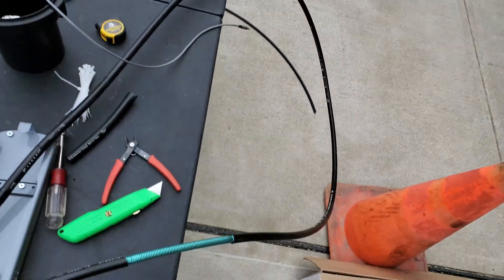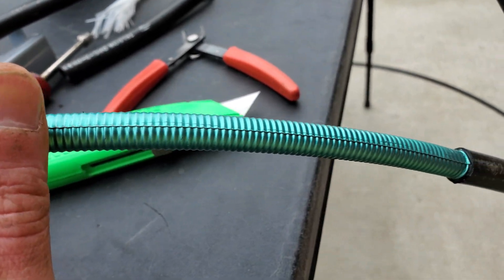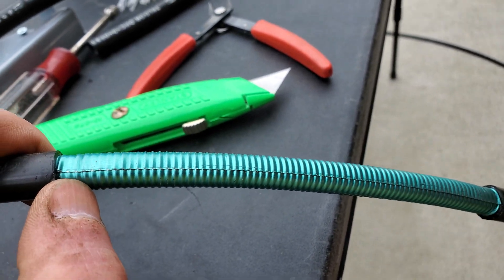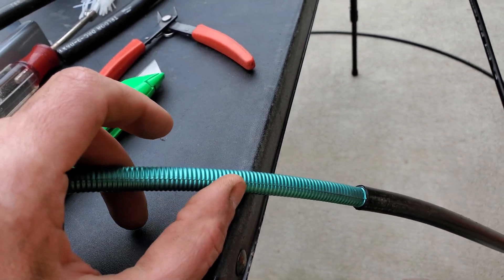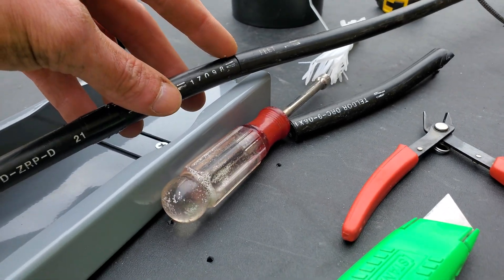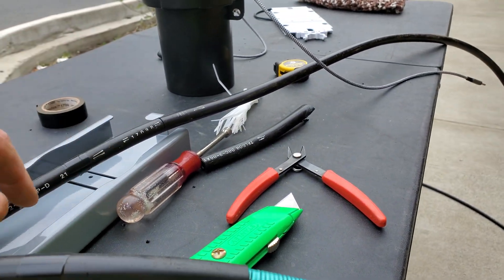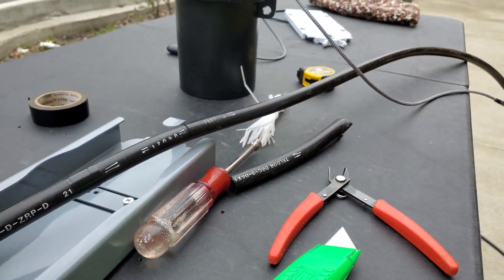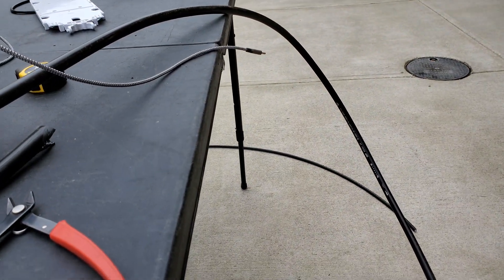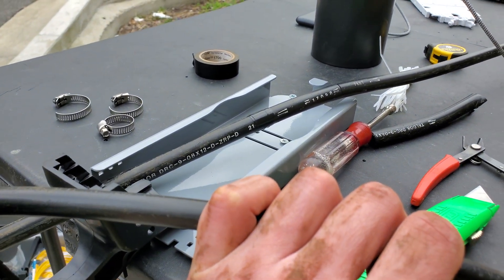We're working on this and it is an armored cable — I've got an armored and an unarmored. I prefer mid-spanning the armored; it gives me a little more comfort. Just use a razor knife, move that, get to the rip cords, and then there's another ring cut right here. That's where we enter with the rip cord and hopefully exit right there. Nice pop. Got my A case prepped and screwed to the table, got my fiber clamps. I measured it out and I think it's going to fit absolutely perfect, though the slack baskets are a little tiny for a mid-span.